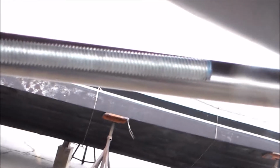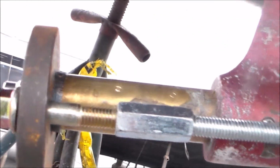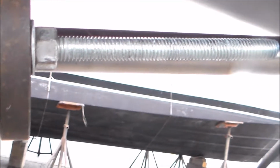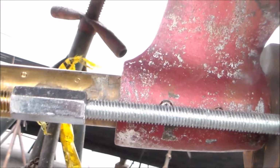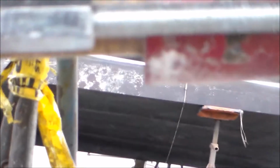And then as I tighten the bolts, it'll draw tight on the all thread there, and it'll push the cutlass bearing right into the strut. At least that's the theory. So let me get a couple of wrenches and we'll try it.